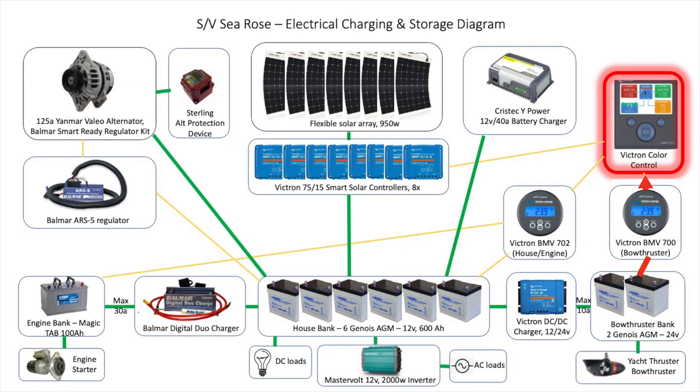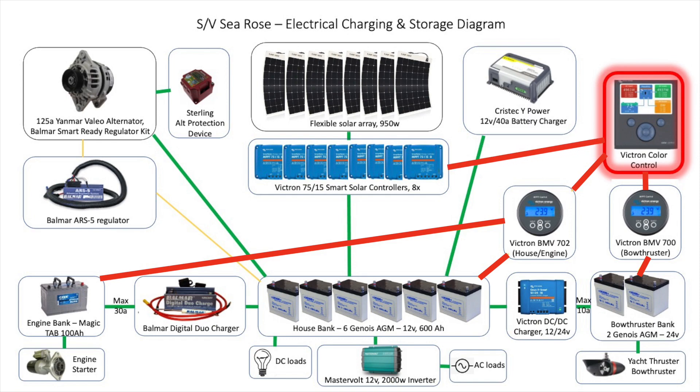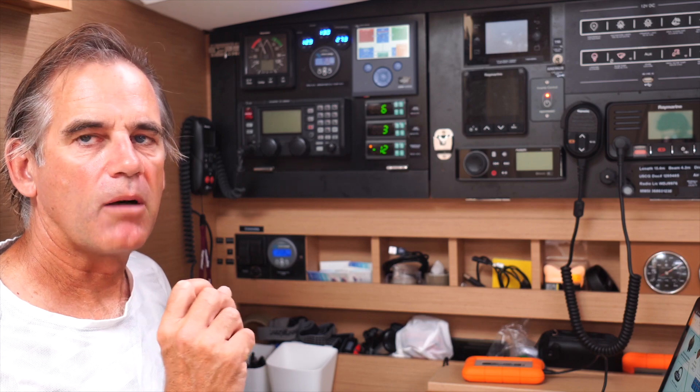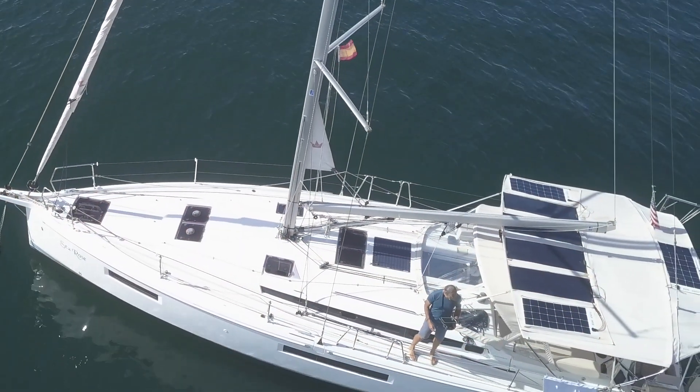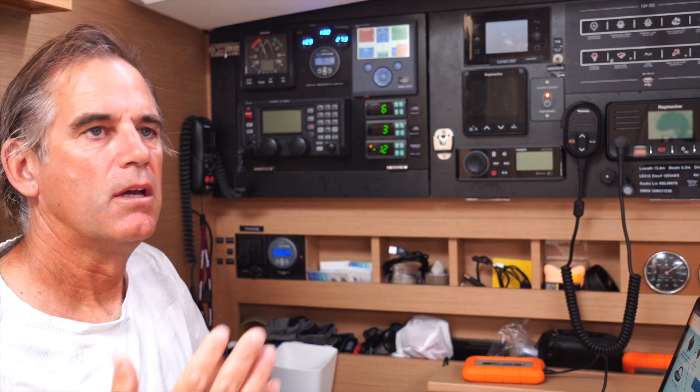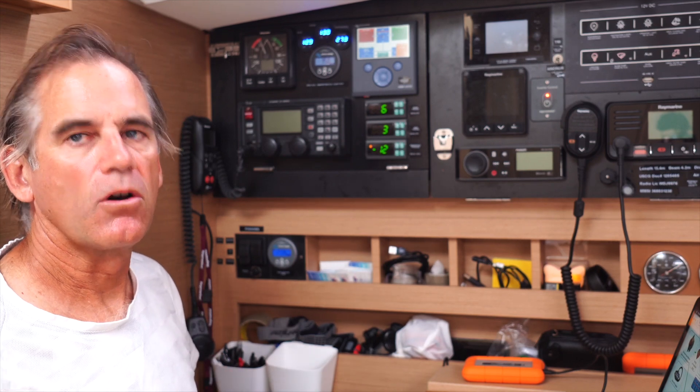This provides a nice graphical view of what's going on. It also takes in the data from all those charge controllers for the solar. It's sending all that in, and this is where I really use it a lot. I'm able to look at each individual solar panel and see exactly what it's outputting at that moment — is it 10 watts, 50 watts, 100 watts? What are those panels putting out? Obviously it helps you diagnose if there's a problem with one panel. It also lets you know the effect of shading on your panels, and we can see in total what our total output is from solar.